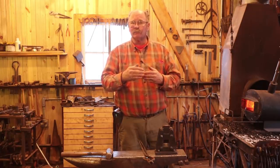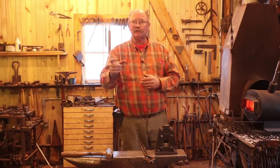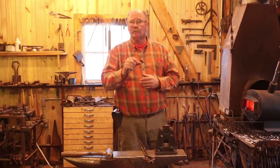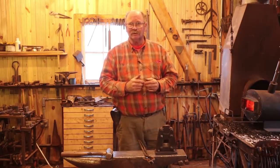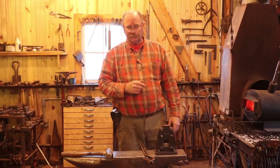That should give me a little bit more than 1 inch of material. I will then take another 1/2 inch and draw that out to the 1/4 inch round, and hopefully have enough for the pin, the rivet, the threads of the wing nut, and then that 1/2 inch round section will be the head of the wing nut, and that should leave me with 5.5 inches of untouched 3/4 inch square bar. I hope that all makes sense. Keep watching, it ought to make sense when we're all done.